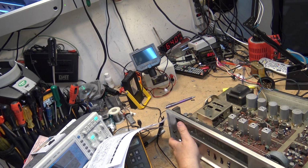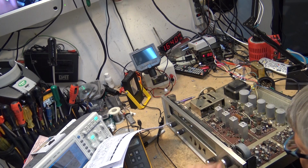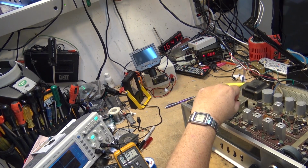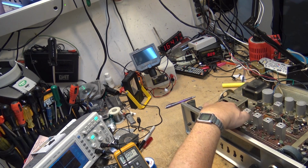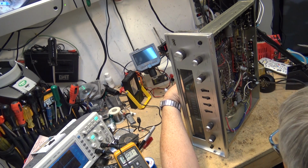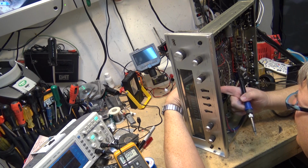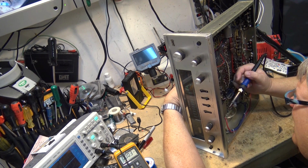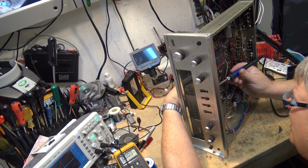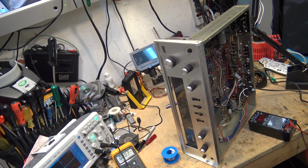I've just got a dead carrier running now on this low end frequency here. The fact that I've been finding so many of these ELNA caps bad in the IF circuit, I'm just going to work my way back and change the other remaining ones and see if perhaps that's what's causing this thing not to pull in stereo reception, because they're all measuring bad. Just got to find it here so that I can remove it. I guarantee you this one's bad. I can just tell by looking at the rubber end on this thing.